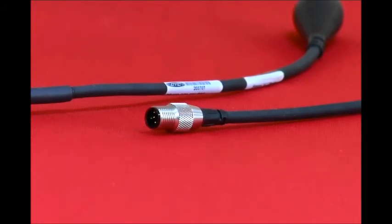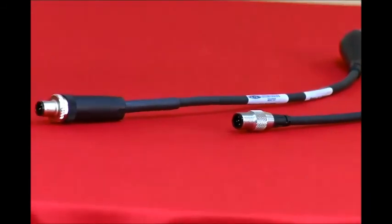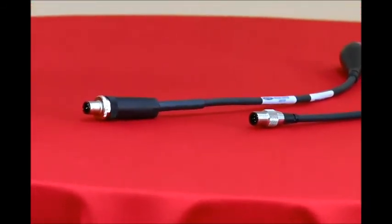The smaller outer diameter also makes it more convenient to use two of the C555 type connectors on the CSI 2140, which has two of the 5-socket M12 connectors for acceleration input, as opposed to the single acceleration input on the CSI 2130. This has been a brief overview of the C555 and C76 data collector connectors from CTC.